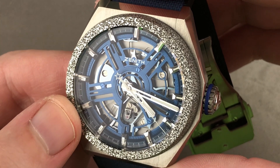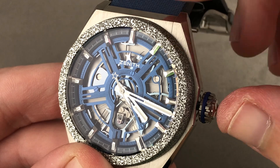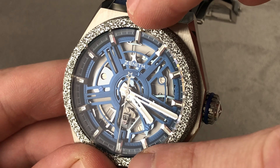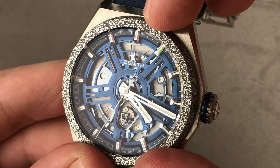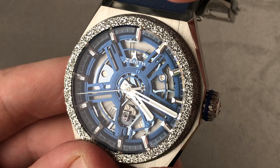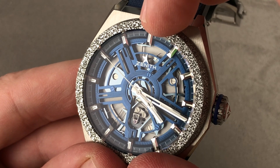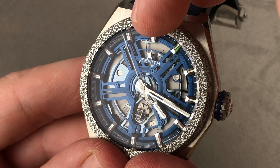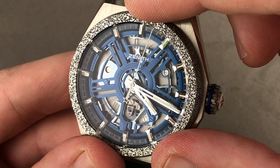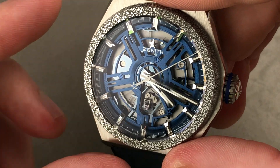This is the caliber 9001 automatic winding, 50-hour power reserve. You'll note that it has a stop-seconds function — the seconds hand stops immediately, but it takes a moment for the oscillator to stop vibrating. The movement features a monoblock that is simultaneously the oscillating mass, the balance, the indexing surface, and the hairspring all in one. It replaces 30 individual components in the watch. This is definitely wave-of-the-future stuff, bringing in technologies previously only seen in the microchip industry. That silicon component is naturally anti-magnetic, so bypassing the Swiss lever and the hairspring with one silicon component makes this an anti-magnetic watch. It doesn't have the audible sound of an Accutron — it really doesn't have any sound to it.